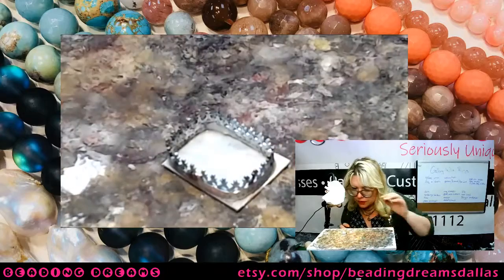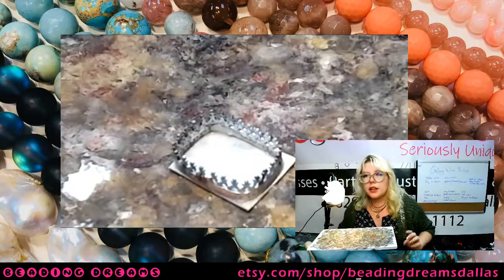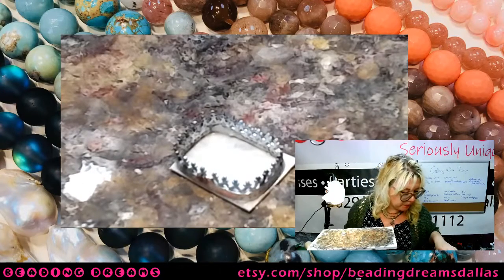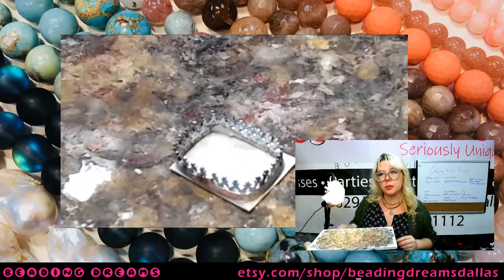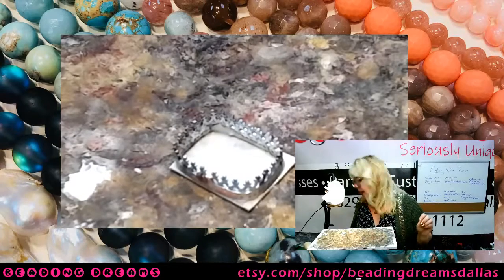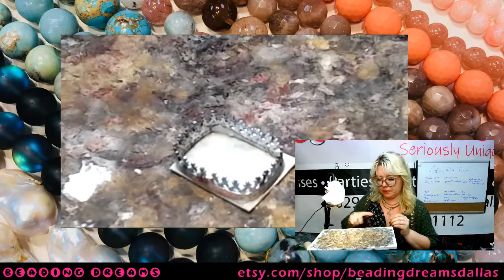And so if you've got even a little bit of oxide that forms underneath there, you're going to have horrible times trying to zip your piece. Okay, so now I'm going to take my extra easy solder. I'm going to do four pieces, one at each compass point. That's actually probably more than I need, but better safe than sorry.